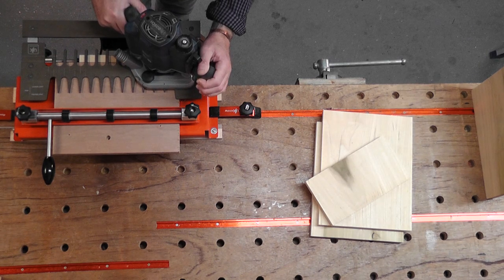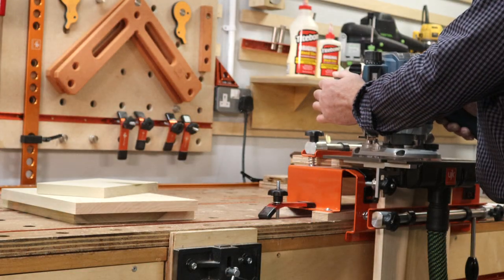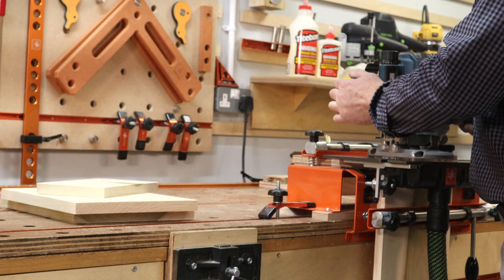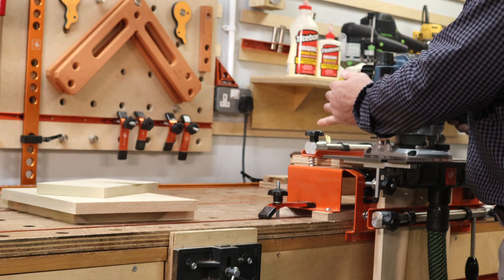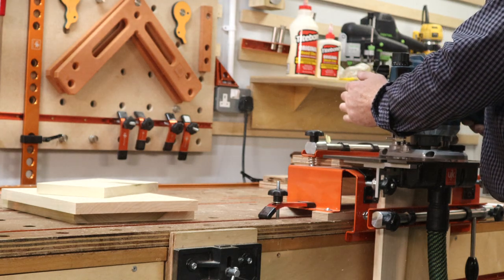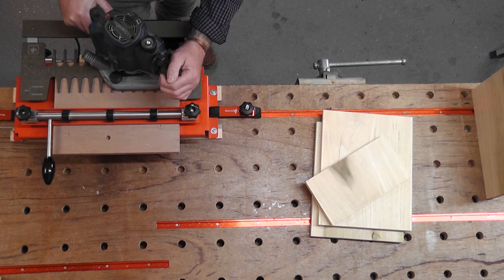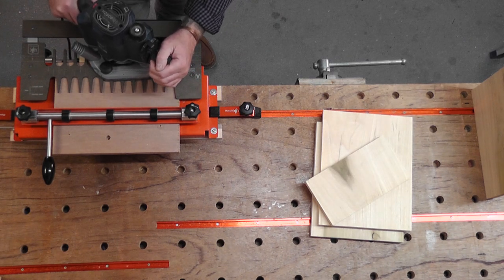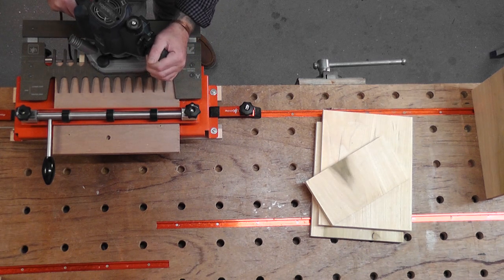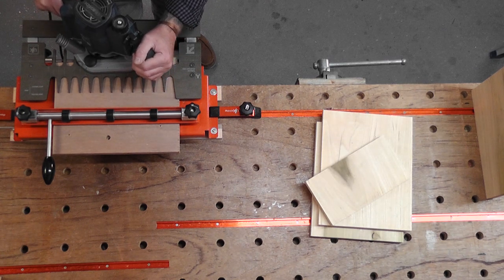So nice, smooth. I'm not pushing too hard. It's quite a lot. We've taken 19 mil by 12 mil out in one go here. So a nice, steady, slow feed through the material. Tulip can be a bit splintery, so I don't want to give it too much and chip out. And going into that ply, that's that extra bit of noise that you hear towards the end. The judder is just hitting into that ply.